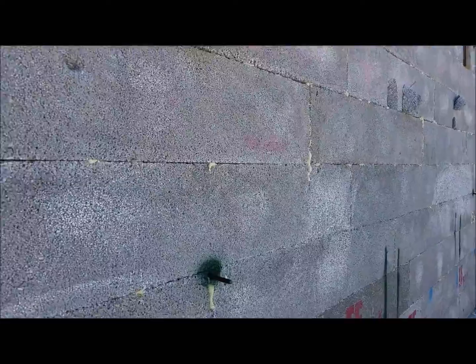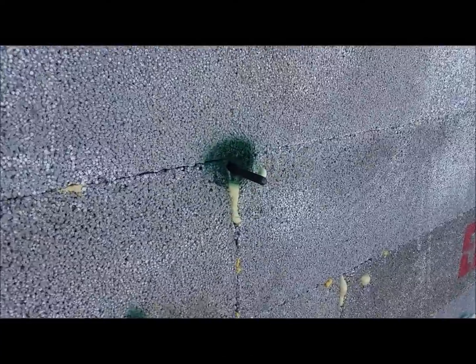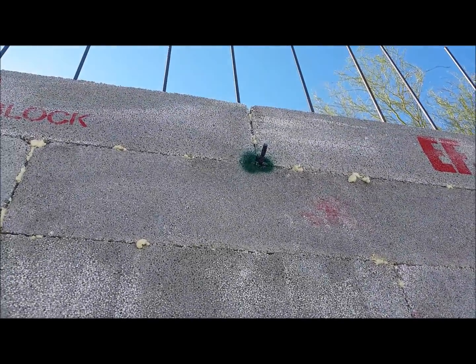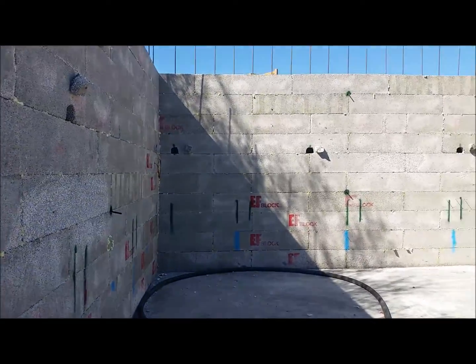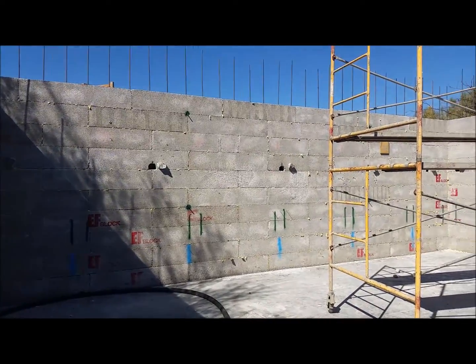This is a neat trick because this building is going up 18 feet. We threw an anchor bolt in here, and then an anchor bolt up there. After we get this grouted, we'll take a two-by-six and nail it to another two-by-six to make an L, and that'll keep that top half from blowing over in the wind.